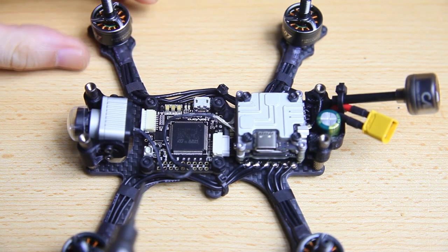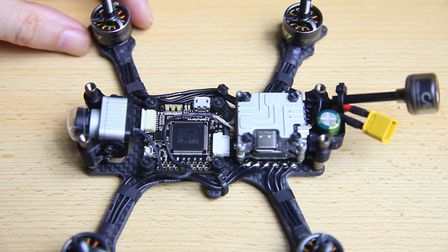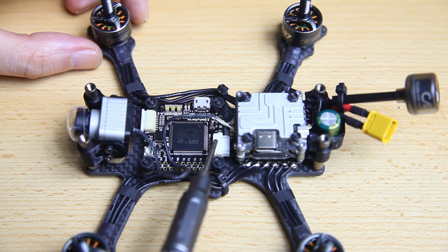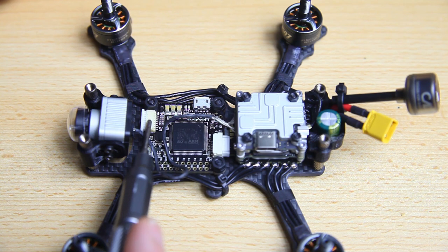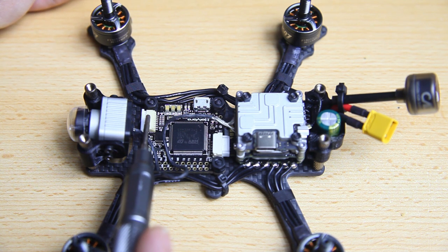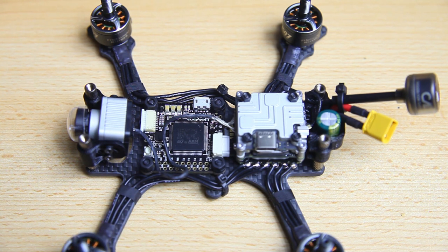And what you see here is actually pretty typical for a digital setup. A quadcopter with a digital FPV system. This flight controller has two of these white plugs. And in the analog era, the flight controllers generally had one of those. At least one bigger one, maybe a lot of smaller ones for UARTs as well. But again, one bigger one to hook it up to your 4-in-1 ESC with a ribbon cable. That's pretty typical, right? And again, in the digital era, we now see two of these bigger connectors.